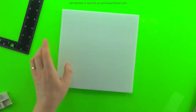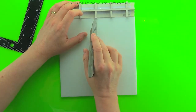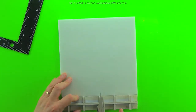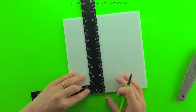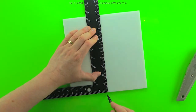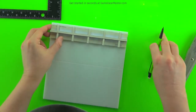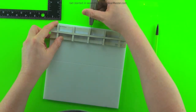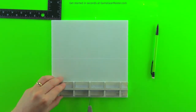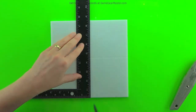Once you've gotten the base cut out, we're going to make two guidelines — one horizontally and one vertically. Line up the jig on the end and make a mark on the side. It doesn't matter if it's left or right, just do the same side of the rib on each mark. Here I'm doing the left side — just draw a line there. This will keep us vertically in line. Then do the same thing horizontally, just to the side of the rib.